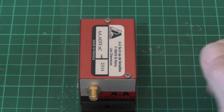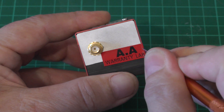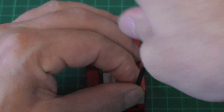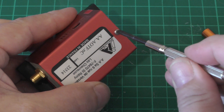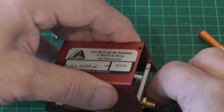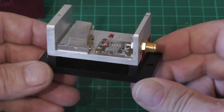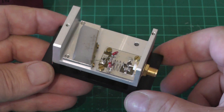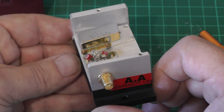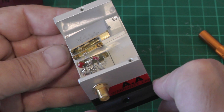Before we go to the computer, let's crack this open - it will void the warranty. On the side there's a little label; I'll cut through that. Inside we've got a very large crystal which I think is tellurium dioxide, and we've got a piezo driver on one side. You should be able to see the gold reflective layer and there are tiny little gold bond wires that attach it to the RF input. It's a really beautifully made piece of kit.